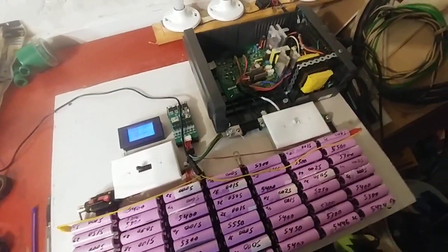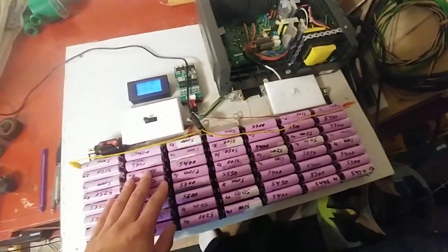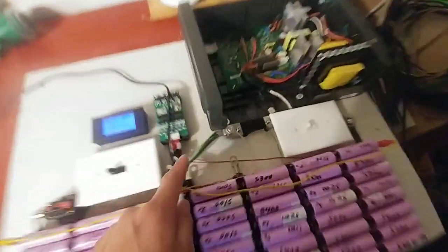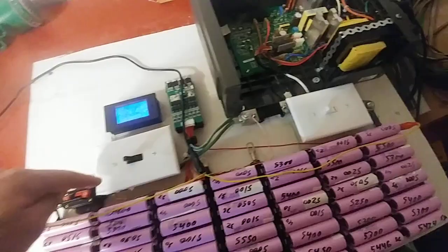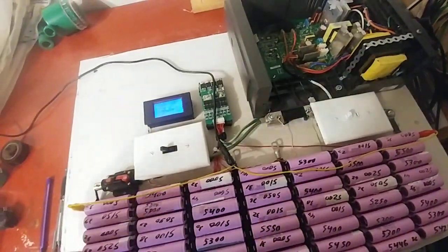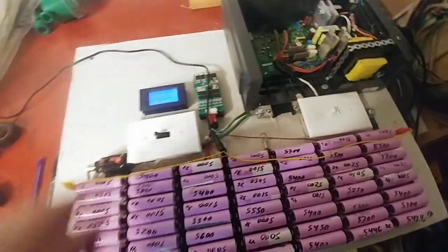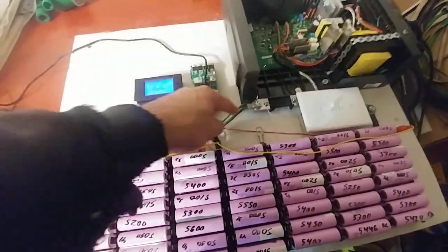I'm going to make a separate video explaining how mine works. I'll go through two really quick things. First one, this switch — it bypasses the BMS. I messed up because this wire here should have been on the other side. The BMS negative should always be connected through to this so that it can be balancing. Because without the negative, it's not properly balancing. That was a mistake — I have to change that.